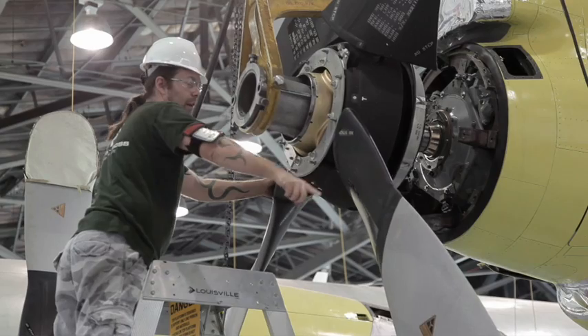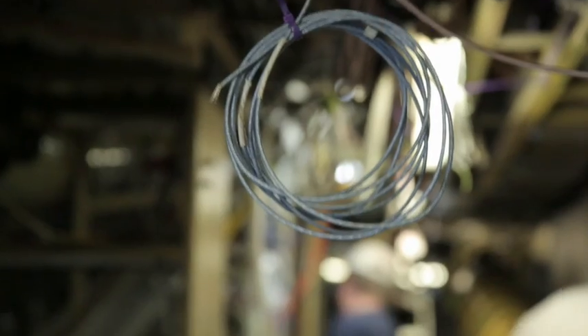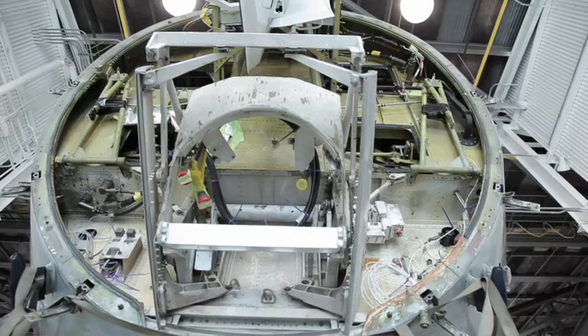The thought of an aircraft coming in from the desert, and we are putting the entire aircraft back together so that it can be useful for another 20 or 30 years — it's exciting. We're bringing it up to the most modern technology we have. We'll put the wings on, we'll put the nacelles on, and at that point the wings are mated and we'll start the repopulation of all the parts that we pulled off from the wings and the parts that came in from the desert.